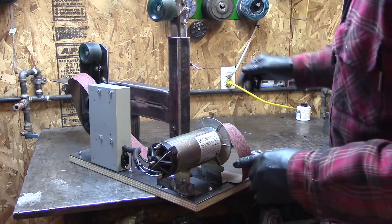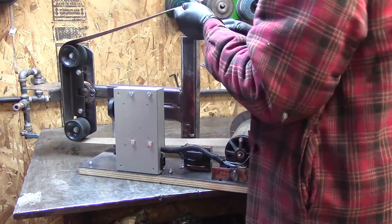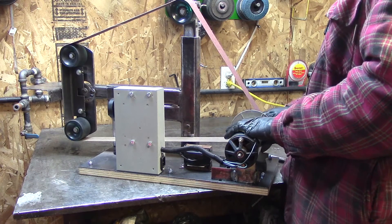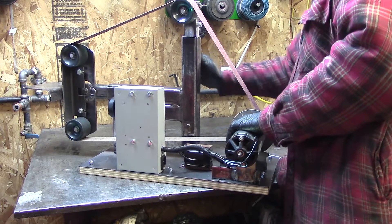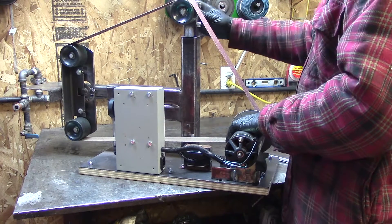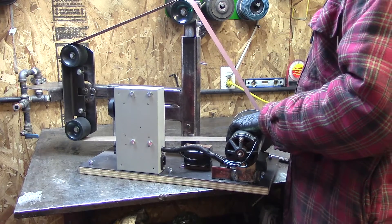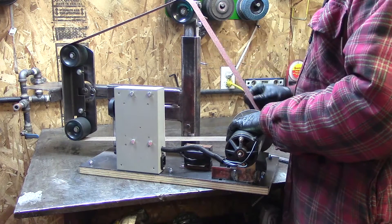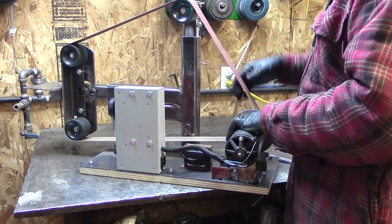Okay, I'll try not to get into the shot here. Let's get the belt back on — push that down. I'm just gonna spin it a bit just to get it close so the belt doesn't run right off, and to allow me to tighten that clamp, because it causes the tracking to change. The motor makes a funny noise when you turn it backwards — this is a clockwise-only motor.